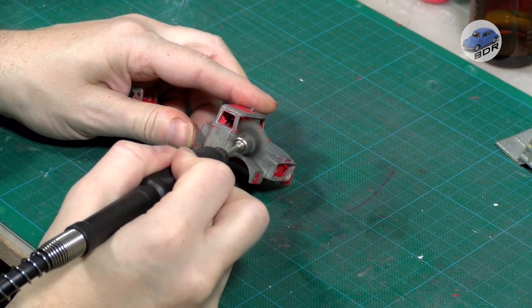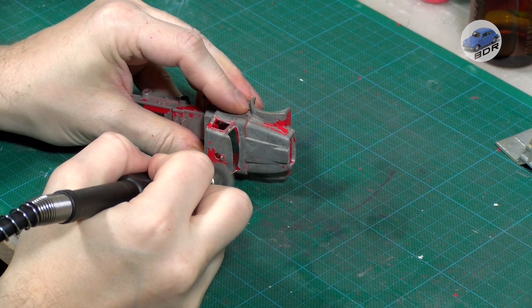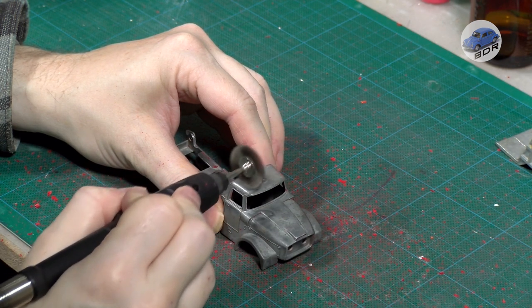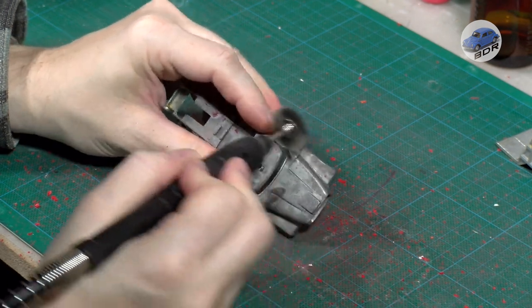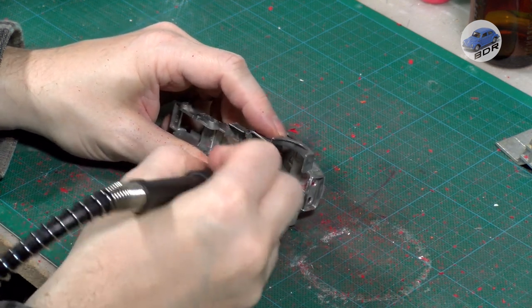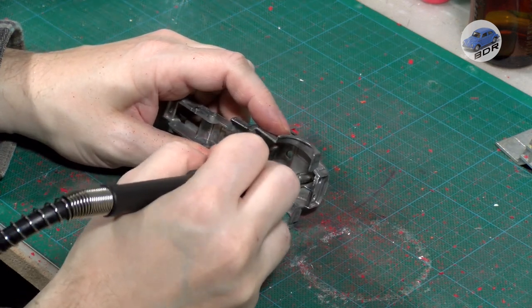When the body finally comes out of the caustic soda, it's an improvement. I use three different kinds of wire brushes to remove every remaining speck of paint. I notice that the body has a slight bend. I compare it to another Scammell truck model and it appeared to be normal. Watch until the end to see if I was right.